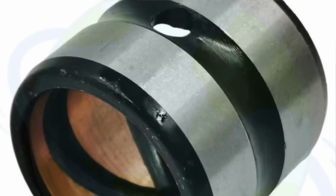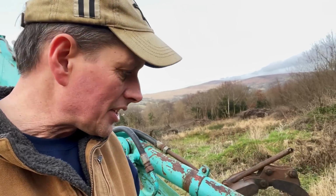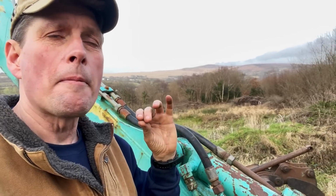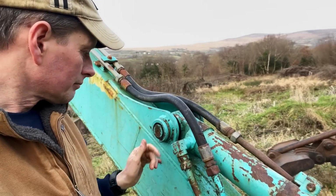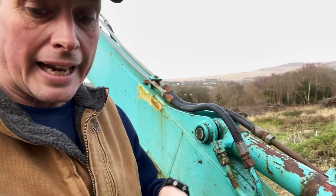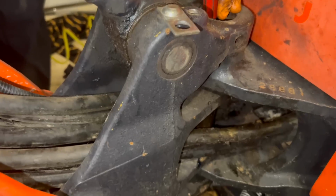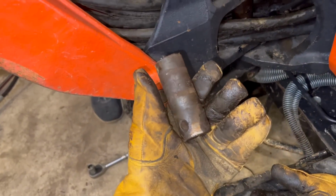It wears the phosphor bronze bushing, and that's got a sort of spiral cut in it, which allows the passage of the lubricant, the grease in this case, and eventually, hopefully thousands of hours later, that can be replaced. And you've seen us do that on the little Kubota, the K008. Yeah, there we go, that's the bottom pin. I'll put a link to that video where we changed the pins and bushes in the description box below and also at the end of this video.